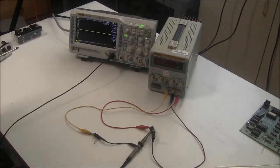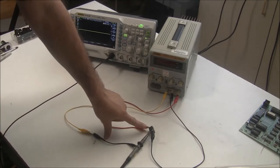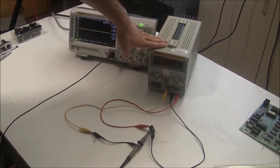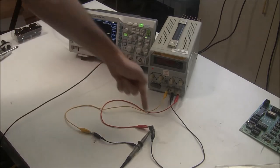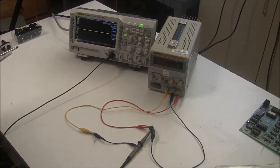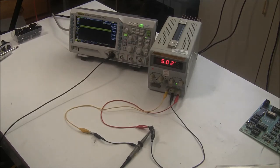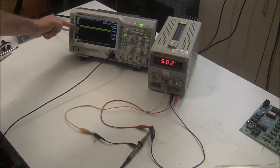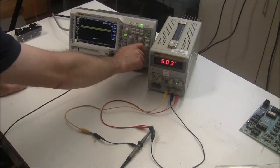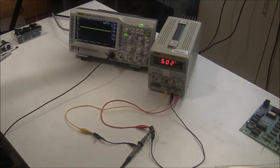Here's my little test setup for the oscillator. The oscillator has 4 pins: one is power — I'm connecting it to this 5V benchtop supply — one is ground, one isn't used, and one is the output. When I fire up the power supply I should see a zero to five volt wave. I'm seeing pretty much the same thing I was seeing when it was in circuit — the signal is between about 1.5 volts and 3 volts, and there it just changed again.